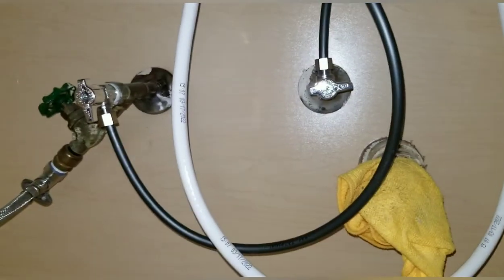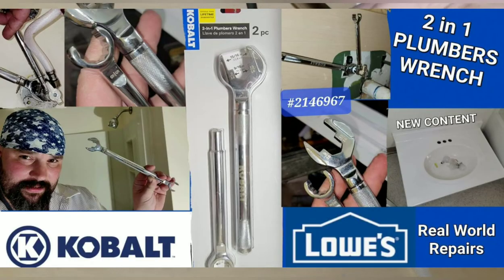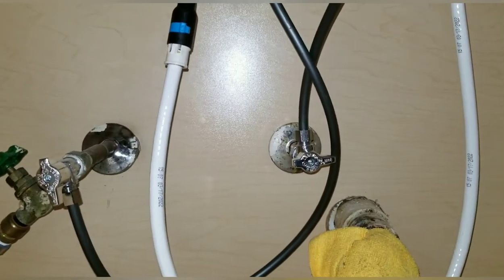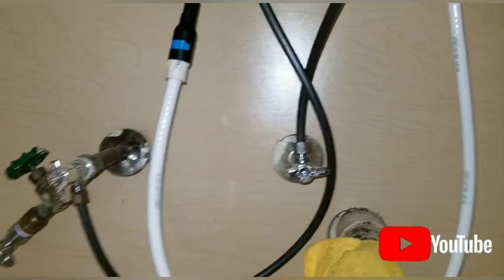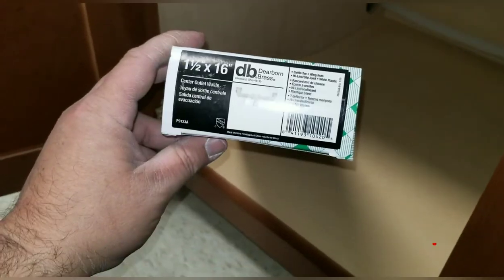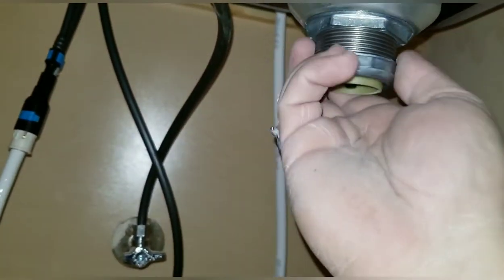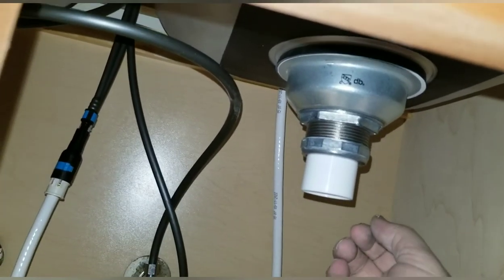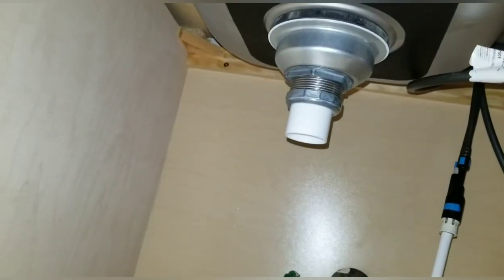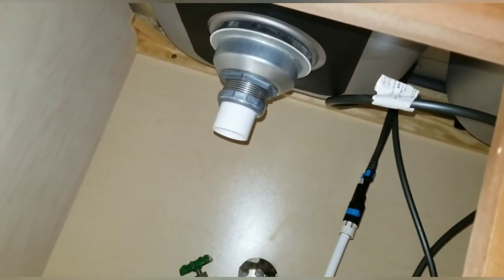The basics on installing this sink are: tighten down the anchors and hook up all your lines. For the drains, break out your center waste outlet and remove all the nuts from your strainers, then tighten them back up on each one. Tightening by hand should be plenty good enough — you don't want to crack them. That seal pushes up against the strainer so there are no leaks. And in the future, if you do get any kind of leak, you want to have a little room left to tighten things up, so don't over-tighten anything.